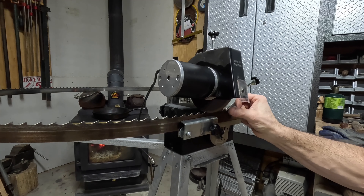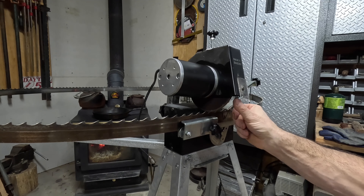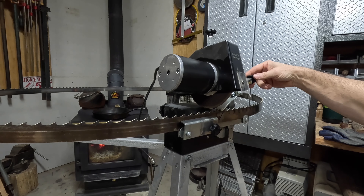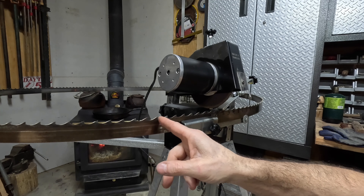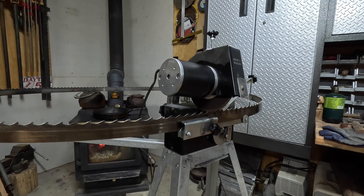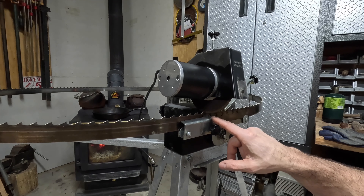The reason why I do this is because if I had the grinding wheel on and it was taking material off the tooth and I kept adjusting the pusher, all those teeth would have a different measurement between them. So when I finally set it to the distance where I want it to be, it would miss certain teeth. So in the future when I go to sharpen my blade again — all right, we're going past the weld, it's way off.